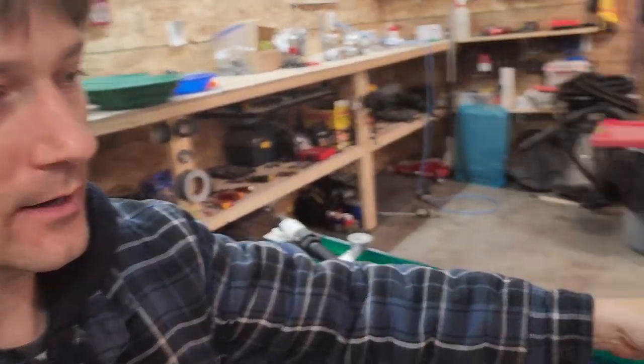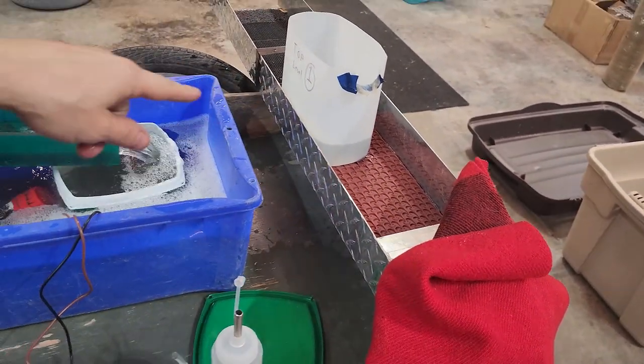I'm going to do one final shot looking down the sluice closer to the bottom where velocity is a little quicker. Adding a spoon — there's going to be a longer delay before that material works its way down that far. This is an example of how a longer sluice helps with surging: I put three spoons in and it wasn't until completely done with the third spoon that this far down the sluice it actually filled up. When the top looks completely full and no longer active, down here the cells are still open, and once this cell filled up the top had a chance to empty down — everything's working well.